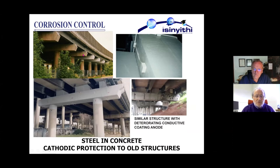Coming back to these early UK schemes, the first of these were on the Midland Links motorway system around Birmingham — about 40 kilometres of elevated motorway. All of these bridge beams have expansion joints above them, and for corrosion engineers expansion joints are really good news because they all leak and drop chlorides onto the top of the beams. The beams began to corrode around year 15, and we were involved in about 1979 in the first trial. These are conductive coating anodes applied to the concrete surface with a protective overlay coating.